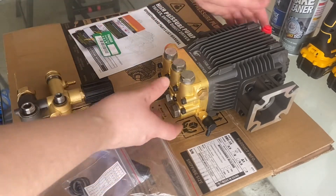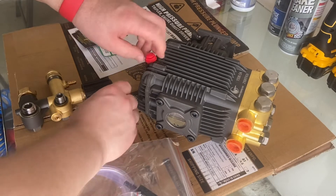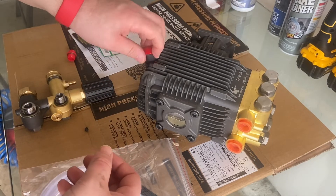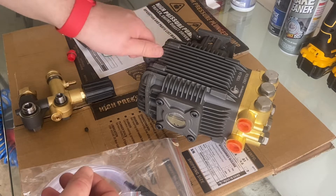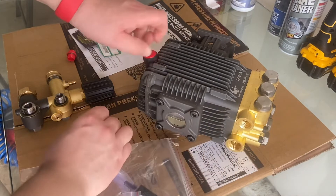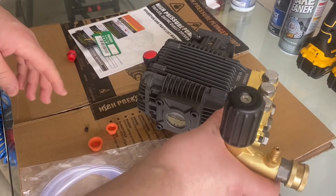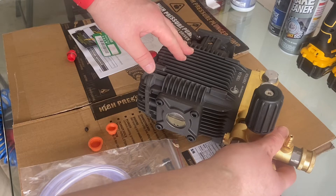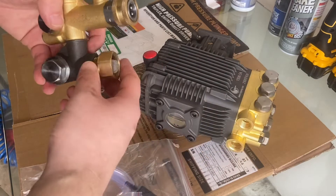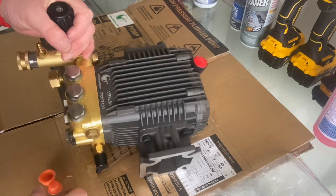What's cool about this unit is it comes pre-filled with oil, which is why the cap isn't tight — I already loosened it so I can switch it right out. I'm going to install this in the next few minutes. The caps are in place just to keep dirt out. You can also put an external unloader on here with a loop for additional cooling for the pump head, or route it to a tank. I've installed the unloader and the unit is ready to be installed.